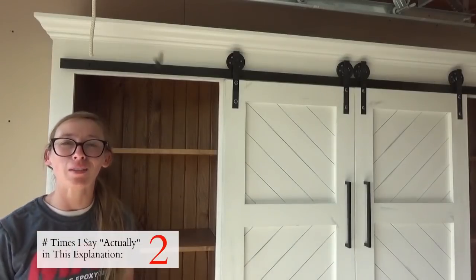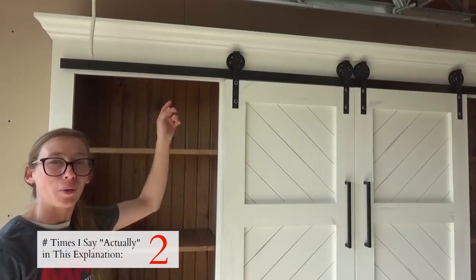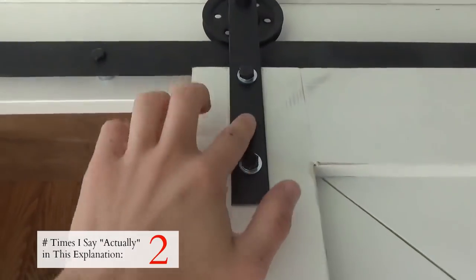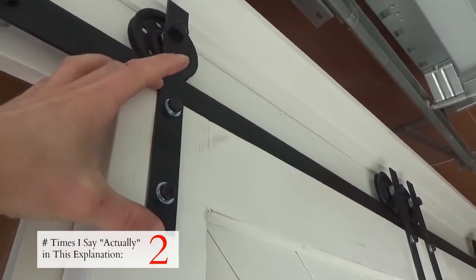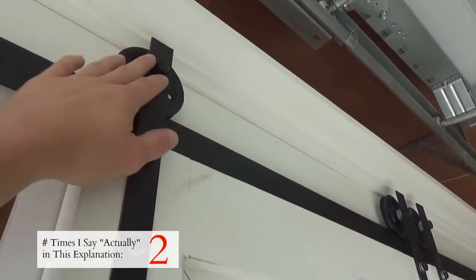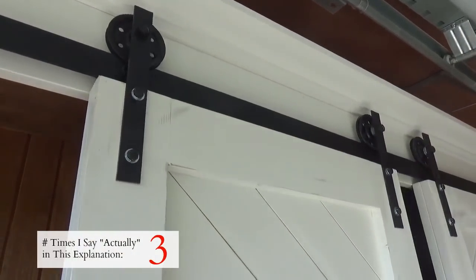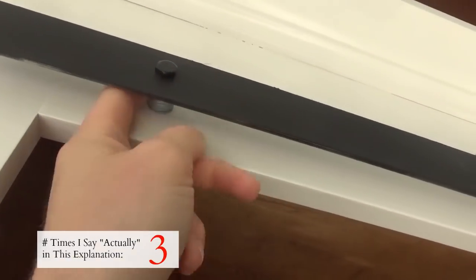I went to my local metal shop and purchased 1/8 inch by 1.5 inch thick steel flat stock. And then I used 1 inch steel flat stock for the pieces that attach to the door here. So I drilled holes to screw lag bolts into the door, and then another hole to attach these garage door pulleys, which is actually what I use for the wheels. I used 5 lag bolts and some washers for spacers.